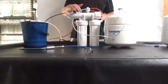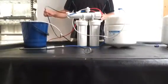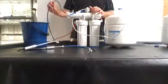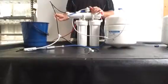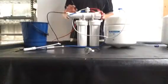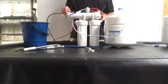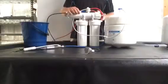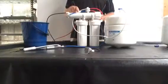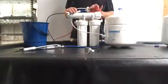When the water goes into the membrane, only water can get through, and anything that's not water gets sent to drain down this black line. So far we've got the red line in, through the automatic shutoff valve, into the membrane, and then out to drain through this black tube, which will generally be hooked up to your drain under your sink by means of a clamp. The other thing coming out is your pure water. It comes out through this port and goes through a non-return valve — in this case an external one. All that does is stop the water back-flowing into the membrane. If this non-return valve doesn't work, you're going to have problems with your system, same as the automatic shutoff valve, so these two things are very important.